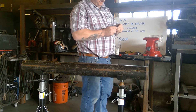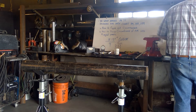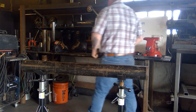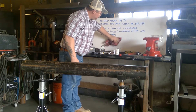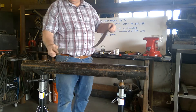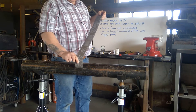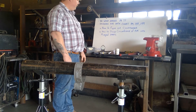Always start off with sharp soapstone — you want to aim small, miss small when laying out lines on a piece of pipe. I'm going to go ahead and sharpen my soapstone. This is a wraparound; they come in many different sizes and widths, some are magnetic and some are not. You'll see there is a scale that we will utilize while using the wraparound.